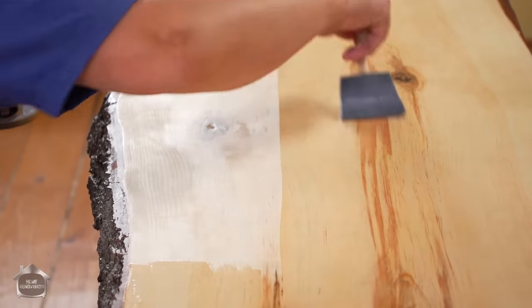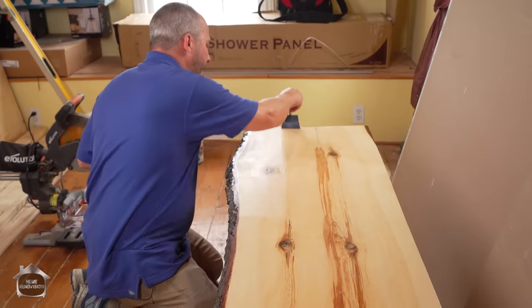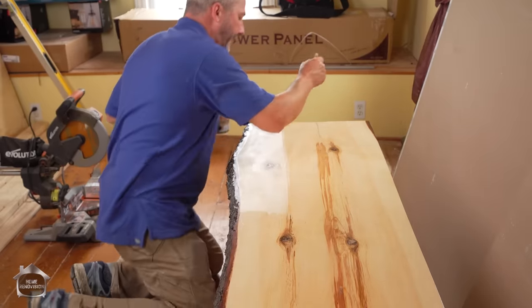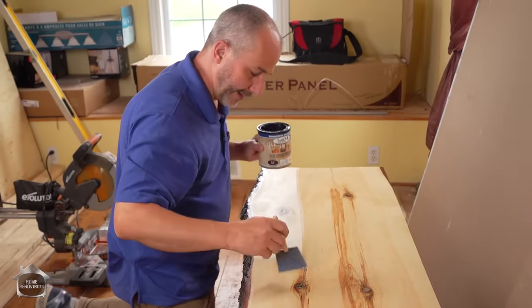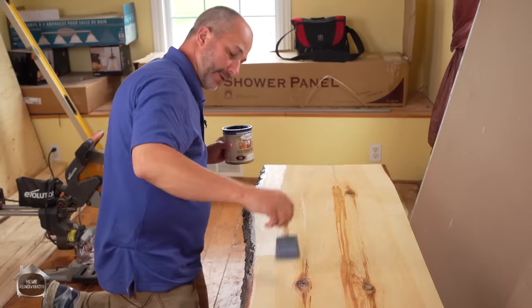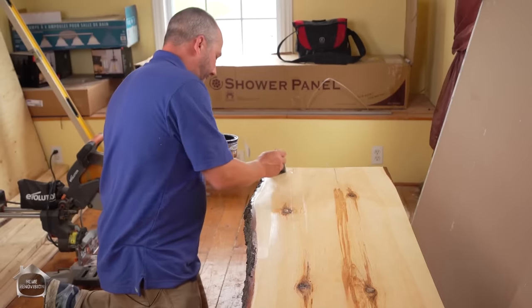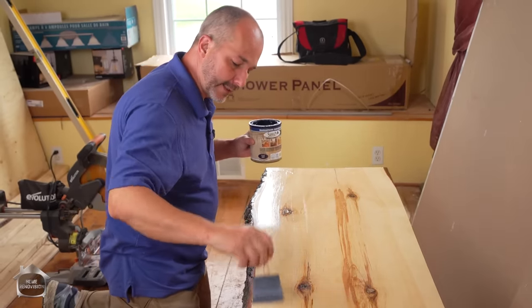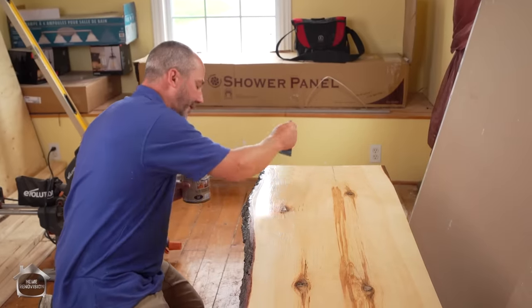wool. Now if you're not familiar with that rating, when you go to the hardware store in the paint department, you'll find steel wool available in little packages. Use about 8 or 10 bundles in a bag. And they're gonna have everything from 2-0 to 5-0. And in the furniture refinishing business, steel wool is very common because it can be spun so fine that it barely sands anything at all.